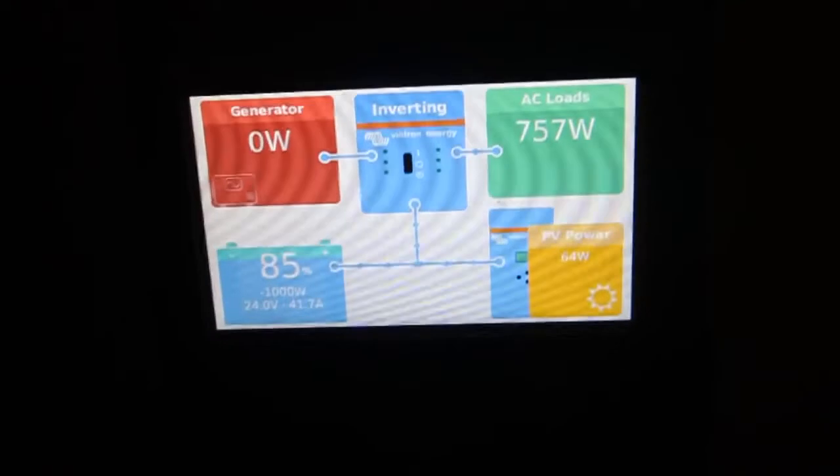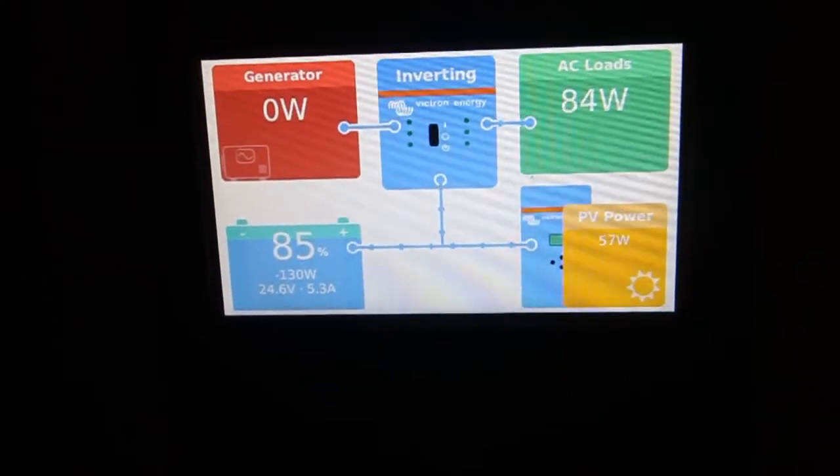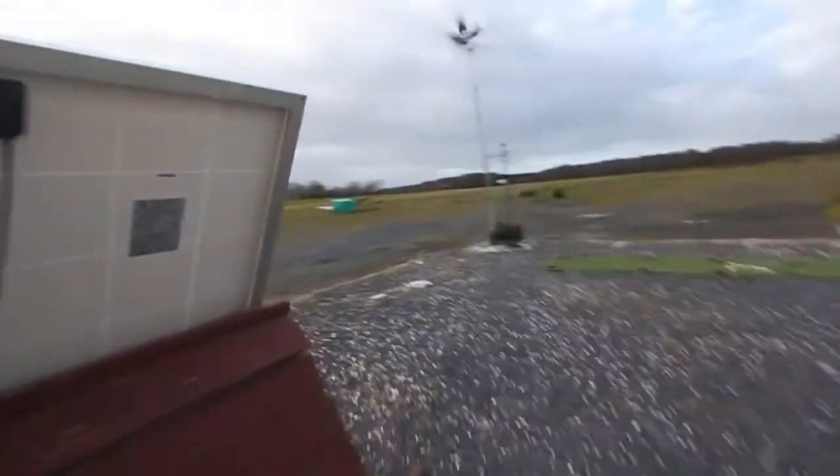Let's see how much that is in power. The Victron fan is on. It's about 700 watts of AC load. You can hear the washing machine because the motor requires reactive power — as the magnetic field requires reactive power. Here is the flooded battery bank I was talking about — it's under the cabin. We have about 400 ampere-hour capacity.